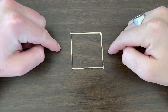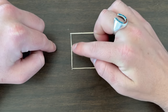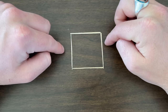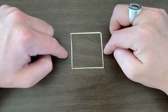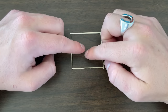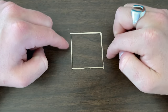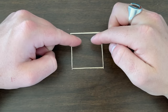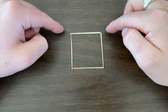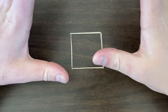Okay, my audio equipment died when I was doing this portion, so I'm just going to explain this really quick. When you're building the frame, you want the negative space to be the dimensions that you want. So you need to account for the thickness of the 2x4s, which are about 1.5 inches wide, so 3 inches. So if you wanted 8 feet here, you're going to want the top portion to be 8'3". If you want to have 6 feet of negative space here, you're going to want to make these vertical pieces about 6'3". That way when you put it all together, you have an 8'x6' space.